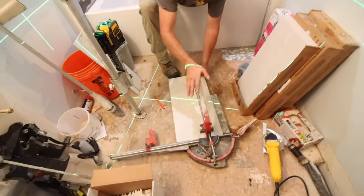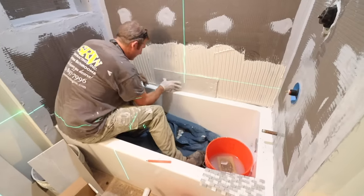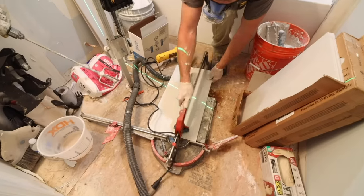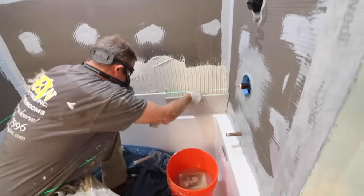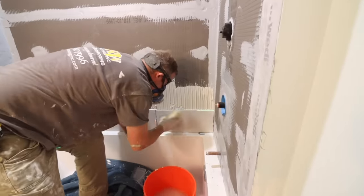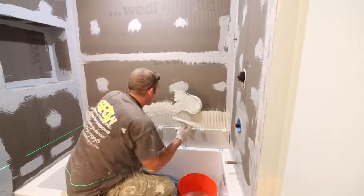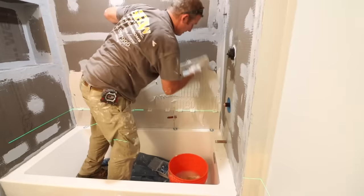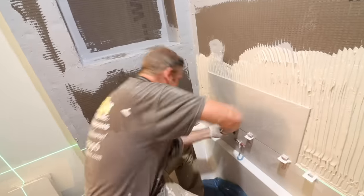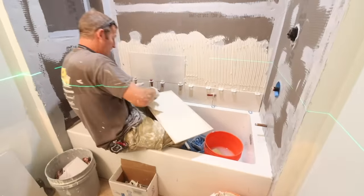We cut down the first row of tile so that it would match our shower niche area, then backbuttered these tiles, set them in place, and centered them on this wall. Always pull your tiles and make sure you have adequate thinset coverage, and you want an expansion and contraction joint between the first row of tile and the tub. We used our manual tile cutter for most of the cuts, but also used a diamond blade and angle grinder to make some of the scribe cuts so that the tiles fit perfectly with the sides. You can also use a tile leveling system like T-Lock to help make sure that tiles are nice and level and even with each other, eliminating tile lippage — which is when adjacent tiles look uneven in relation to each other. You can level the tiles with your laser level as you go up the wall, and we highly recommend that for beginners to get professional results.